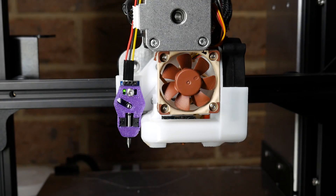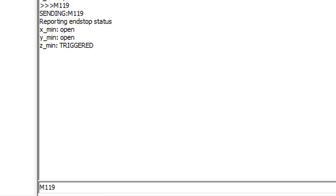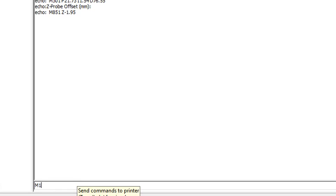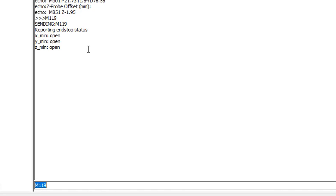Let's continue our install by looking at the required firmware changes in Marlin. A reminder that if you're on an Ender 3, you will need to burn a bootloader first and also have a copy of the Marlin source that you can edit. First up, we're going to test our wiring. If we have our probe up and use a program like Pronterface to connect via terminal and USB, when we type M119 it should say the Z min is triggered. If we manually lower the probe and run M119 again, it should say Z min is open. If this is what you get, we're ready to do firmware.